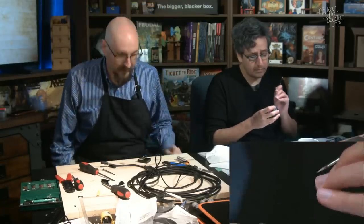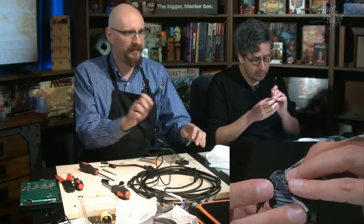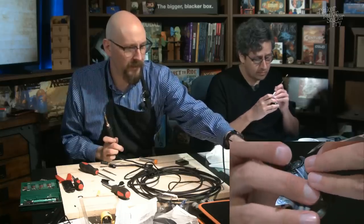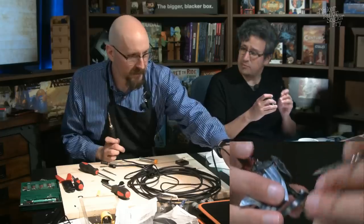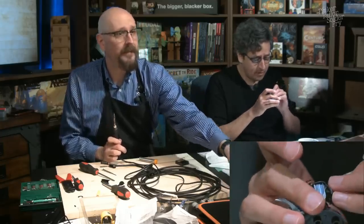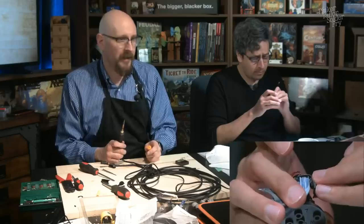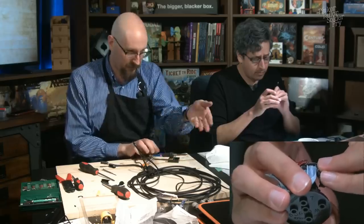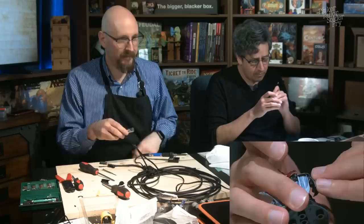All right, let's get this. No more than 500 milliamps, says Hanarin. Really? 5 volts at 2 amps. Now, USB now pushes 3 amps, doesn't it? And higher, I believe. There's too many people saying USB 3 can go way higher than 2. Yeah, so standard USB plugs like this one, you're going to get up to 2. But well, now I know.